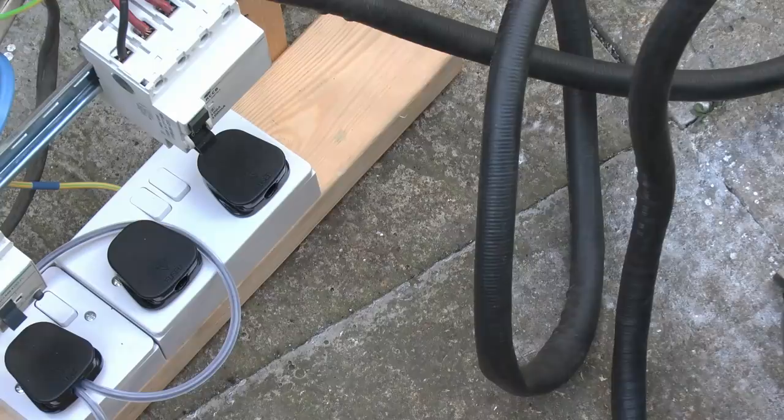So that is a rotary phase converter — single phase in, three phase comes out. And you'll see from that quick test we did there, the output voltages are not all balanced, so some of the capacitors may have failed in that box on the back, but we'll look at that at a later time.